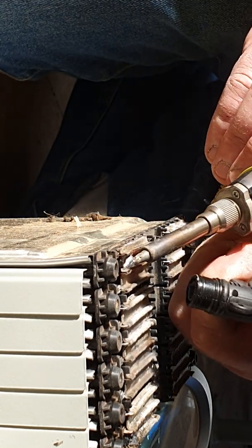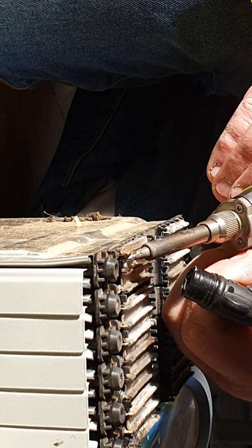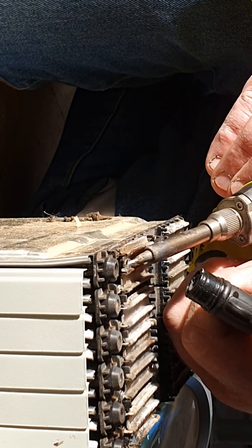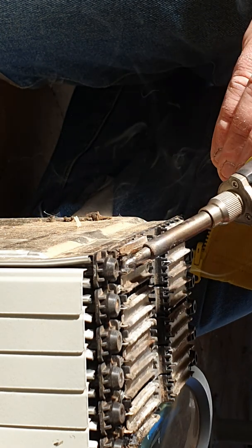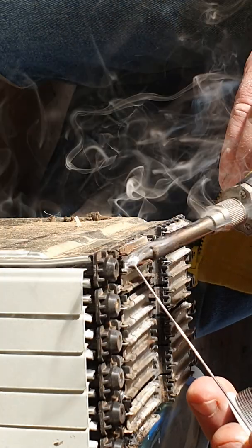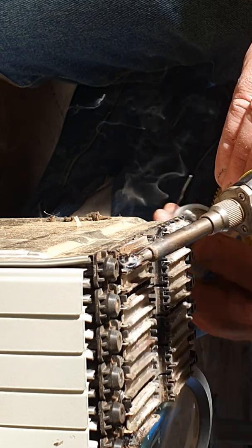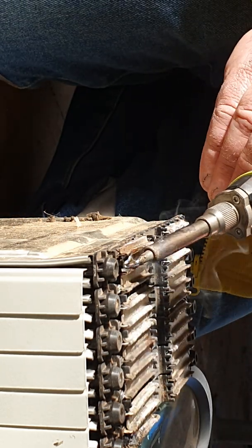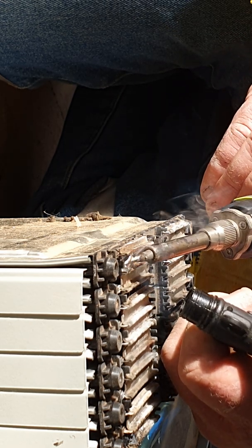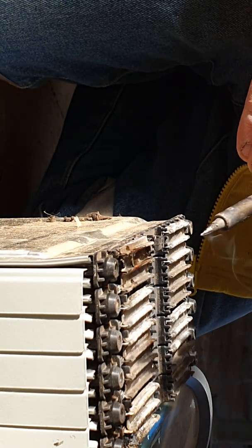What we're trying to do is get enough heat in. There it is, all running in — we'll add a bit more solder. It nearly solidified itself. We'll put another heap of lead solder on. See there, it's not even taken, but as soon as we get the heat into it, there it is — you can actually see it running now. All tinned up, all done and dusted.